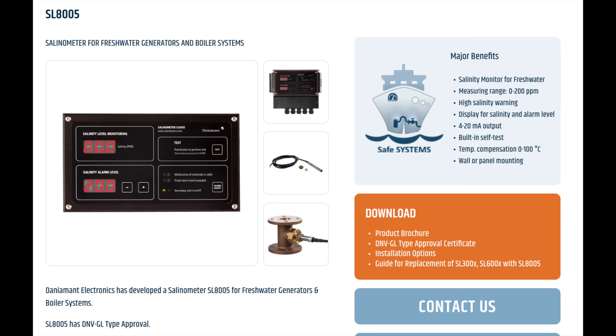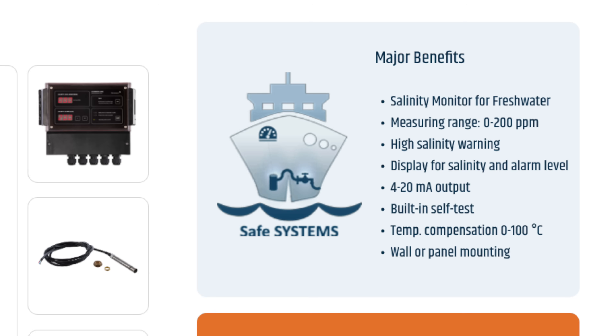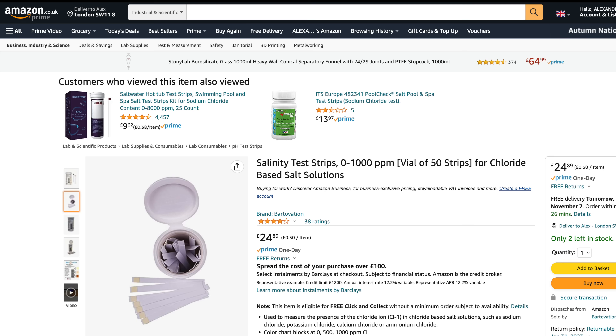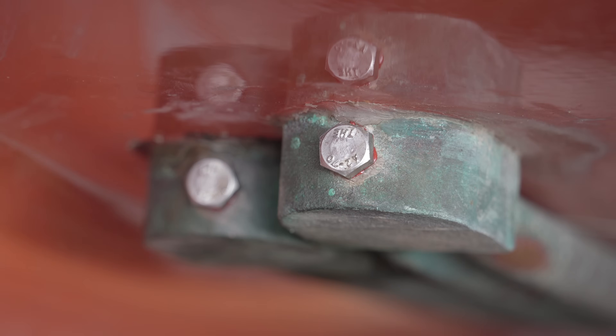I showed you this last time round. I want a way to easily check that my freshwater cooling circuit hasn't been compromised whilst underway. To do this, I need to test for salt in the coolant. This machine apparently costs many thousands of pounds, so Alan will have to do without. But I may invest in some basic salinity test strips, so every now and again I can dip it into the header tank's reservoir and see if any seawater has found its way in, signalling a problem with the keel cooler.